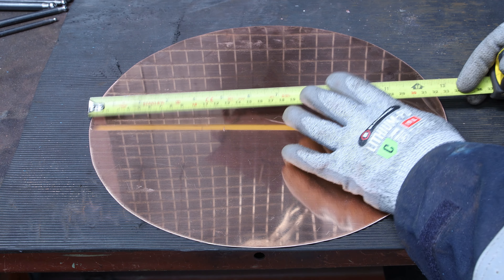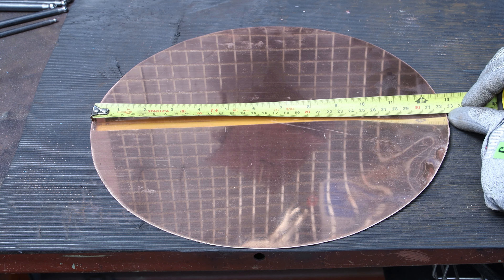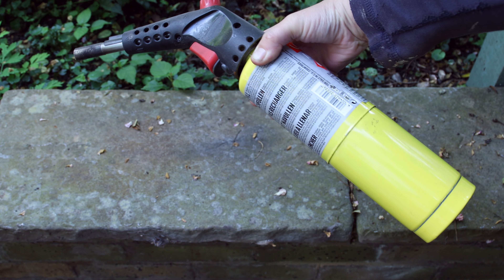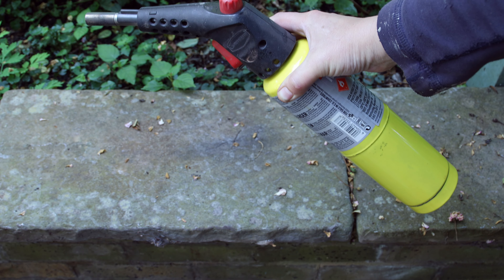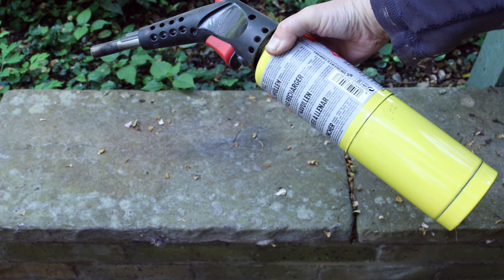My disc was almost 33 cm and my final piece was just under 26 cm, so once again roughly 20% reduction in size. To work on that sheet of copper I need to anneal it first. On a smaller scale a small torch with propane works absolutely fine, but on a bigger scale like what I'm about to do I need to get the big boys in.